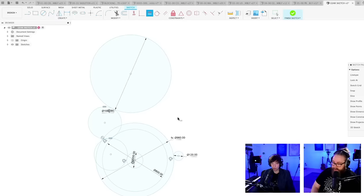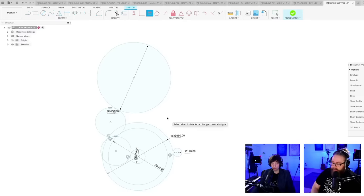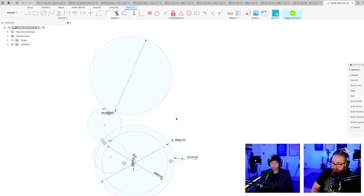Jeremy Heidi, chains are hundreds of extra moving parts. Yeah. That's something to think about. What I like with a chain compared to a timing belt is that you can open it, which means that I can assemble the whole machine and then open the chain with a little chain lock thing, put it on top of your gears when the whole machine is assembled, stretch it together and lock the chain. So from an assembly perspective, a rigid loop of a timing belt is not nice to work with. So I think it's a big pro.